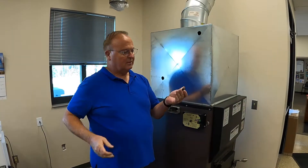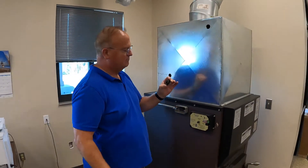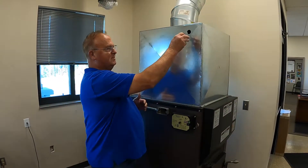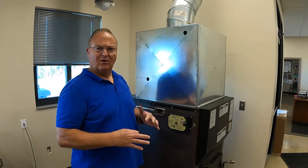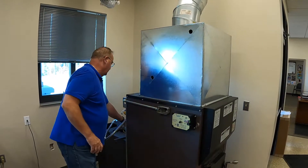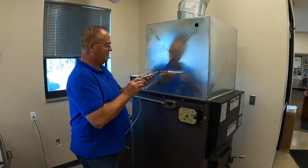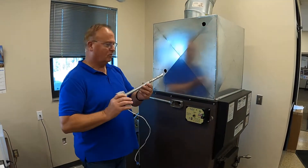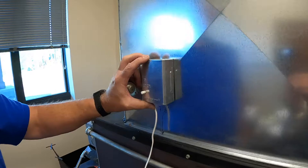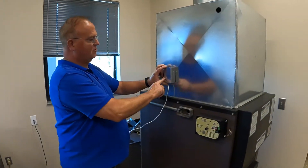This is the low-limit thermostat — it's generally called a snap switch. They're actually quite reliable. This low-limit thermostat is what turns the blower on and off; it's the on/off switch for the blower. We also have what's called the high-limit thermostat. The high-limit thermostat is what a lot of people call a fan control — it's made by Honeywell and gets mounted down here. We use this as a safety device. Always make sure the white button is pulled out.